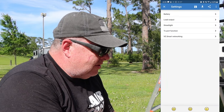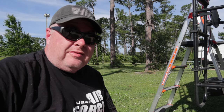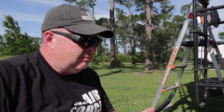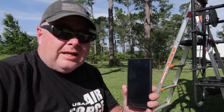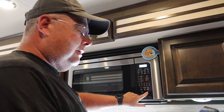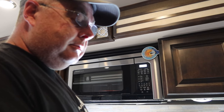We need to make some configuration changes based on whatever battery you're using. Mel's taking the cardboard covers off the panels so we'll see if we're getting charge. The screen recorder on my phone stopped working, but we are getting about 18.98 volts. Right now we're at 90% state of charge running entirely on batteries with the shore power breaker off. In our previous setup with the four six-volt batteries we could only run the microwave for about 10 seconds. Let's put it on two minutes and see what happens. Our voltage is 13.7, and it drops to 12.17 — and it's already surpassed the old batteries. It's running through the inverter and looks great.